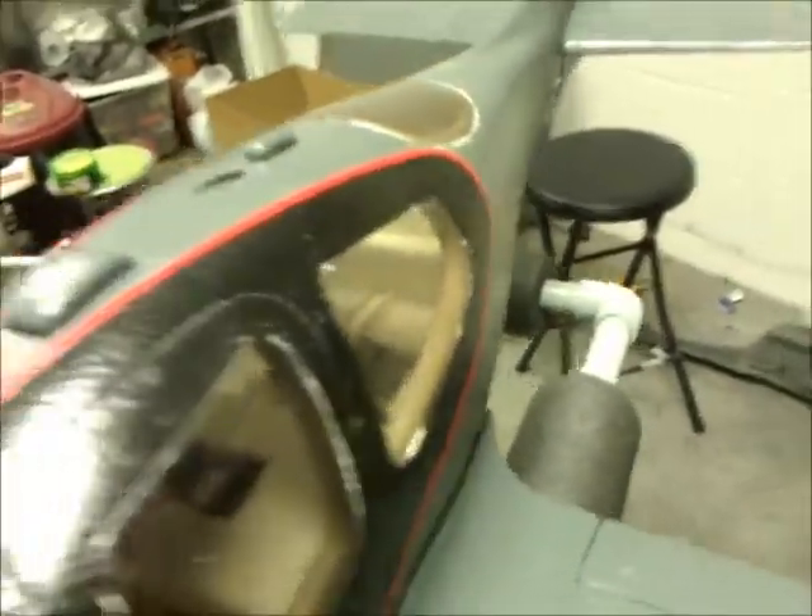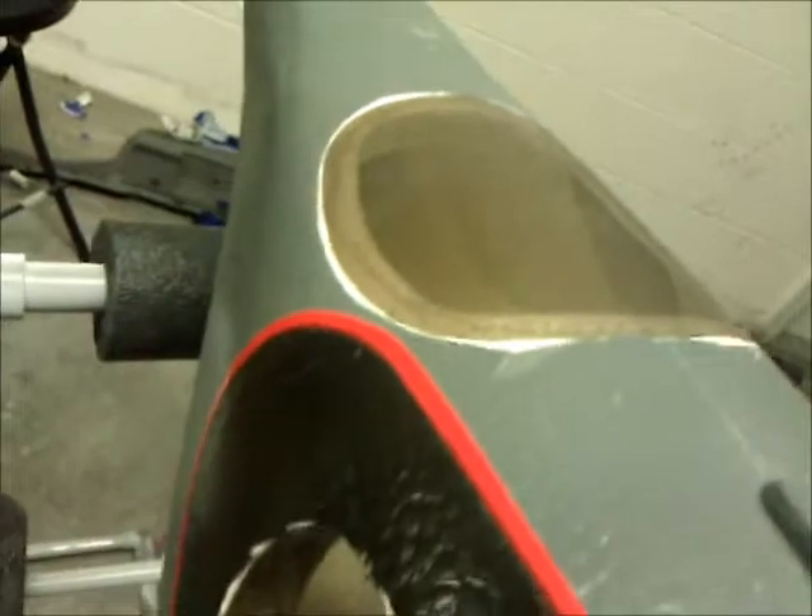As you can see, not too bad overall. Some areas like around the windows — when I pulled out the tape, I noticed that I taped it off all the way to the styrofoam instead of just doing the window. So if you ever have to mask around the windows, just make sure that you stay around the window. It's better to paint just a little bit more from the window than to go all the way to the styrofoam.